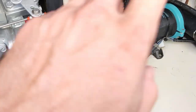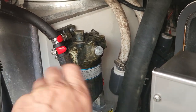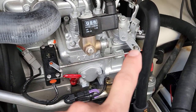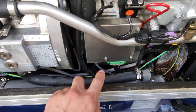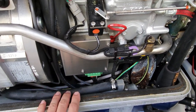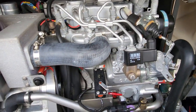The fuel filter in the boat is right here - it's the same Racor-style Parker filter that almost all manufacturers use. So we'll replace that filter, do a normal fuel filter service, clean all this up, change the oil, and this thing should be ready to go. I'm not going to attempt to run it because we already know we have problems. There's a sender for water detection down here - just two wires - and when water touches them it activates the alarm inside. I'm going to shut it down so we don't suck water into the intake, which would be catastrophic for this diesel.